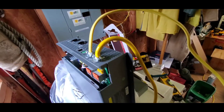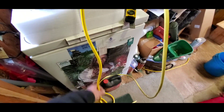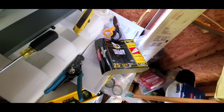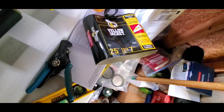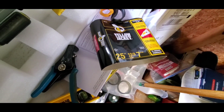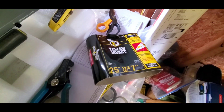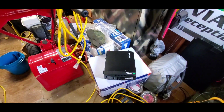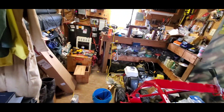I figured I'd get all the wiring and everything set up before I mount it on the wall. I'm using a Yellow Jacket 25 foot, 12-3 cord. I didn't want to hard wire it because I'm not going to have it wired all the time — if I need to, I can plug it in. That's a good cord. 12-3 is the biggest size you want to go with this; you might be able to get 10 gauge in there but I highly doubt it. 12 is good all around — good for 15 amps. The old inverter is laying here, that's off the wall.